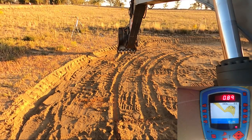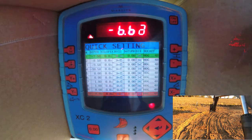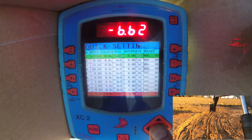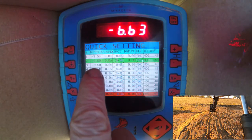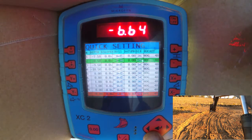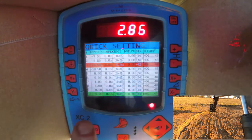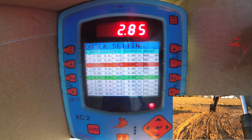What we've got now is we have programmed all of our footing elevations into the Quick Set menu. The green one right here we've got for a seven and a half foot cut. The next one down, we're going to drop our next footing down to eight and a half feet. Next one nine and a half, ten and a half. So what that number represents is seven and a half feet below the laser reference line — the laser beam.